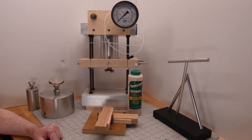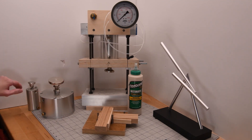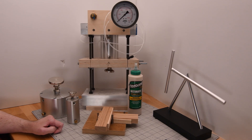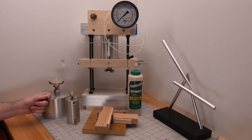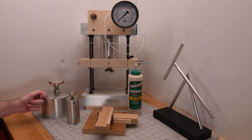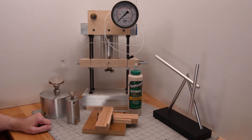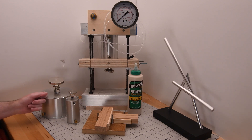For the clamping force, I'll be using either gravity or one of these three air cylinders. For those low pressures I have some weights I'll be stacking on there, because this air cylinder would only need a fraction of a psi and you can't be accurate at low pressure. It takes at least two and a half psi just to get this cylinder to move, and about four and a half psi to get this one to move. So you need to use high pressures to be accurate.